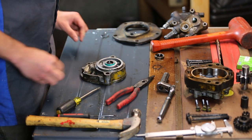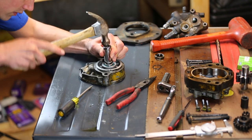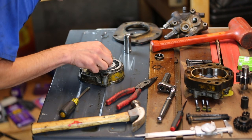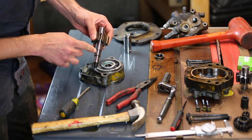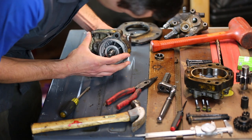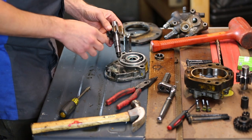I don't want it to go in too far, but there is a lip on the inside of the bore that prevents me from pushing it in too far. I want to make sure the lip of the seal doesn't line up with the grooves on the shaft. After checking the measurement, the lip does not quite line up with the groove, so it looks good. We'll leave it as is.